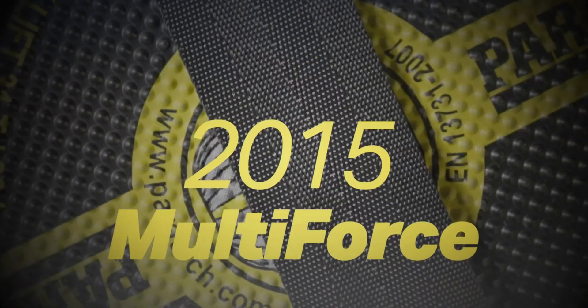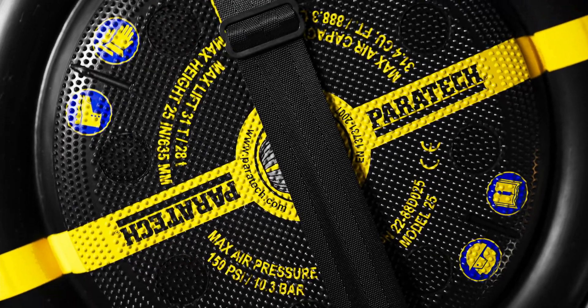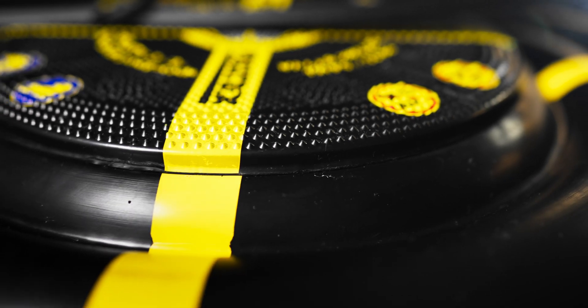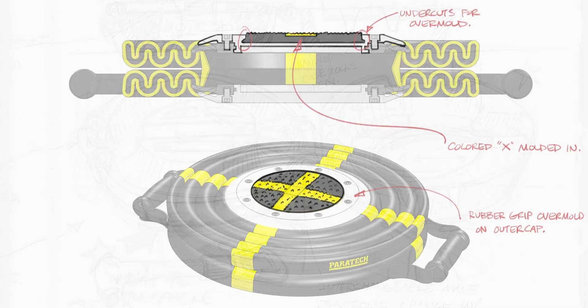Pushing lifting to new heights: the Multi-Force. It was a project that started when I first began my career — the most significant, most challenging product I've been a part of. There's a reason why this product hasn't been copied by anybody. How do you take something that's figure-eight shaped and hollow inside, laid up in its raw state, get it into a mold and into a flat state so it can be vulcanized, so that when it comes out it's flat and fits into a small space? Without getting into proprietary details, it took years to develop and a lot of people to get it done successfully.